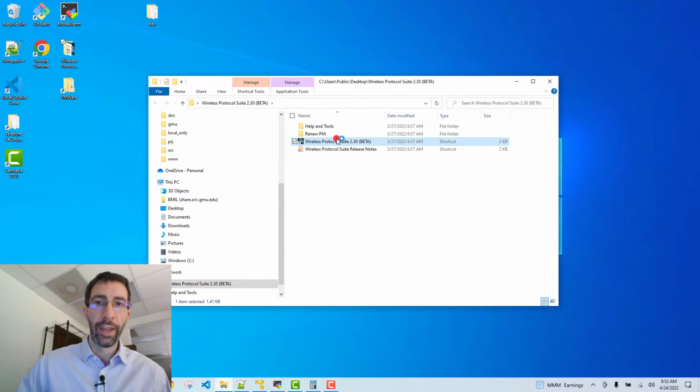I'm going to do automatic attenuation. For wired, I'm going to select port 1 and port 2 because we have both controllers set up. Select the pods, the sensitivity medium, and then pod 2 and click OK. Also, make sure that the wired devices, both USB 1 and 2, are selected. Now, I've already chosen the addresses here, so you could add those addresses from add address, and then I've checked those. And I'm going to now select start record and start analyze.